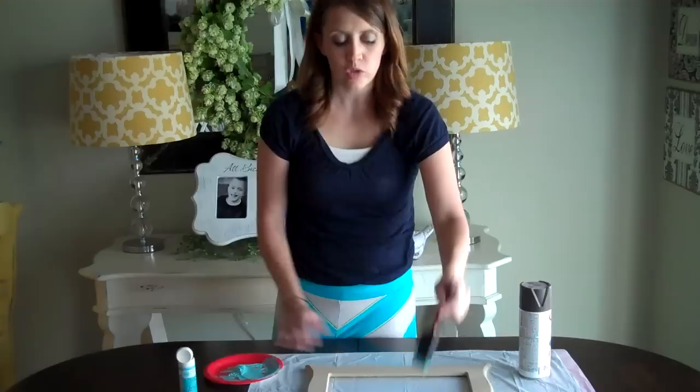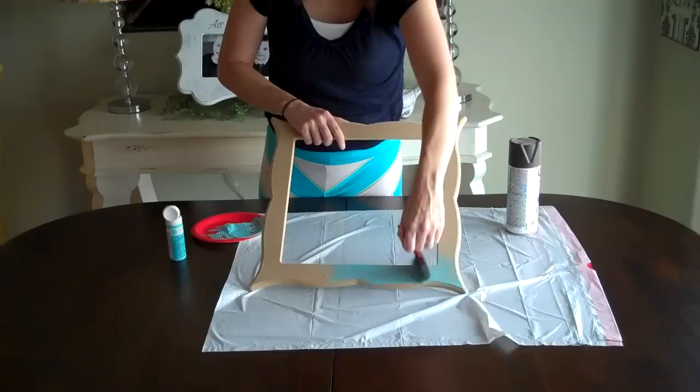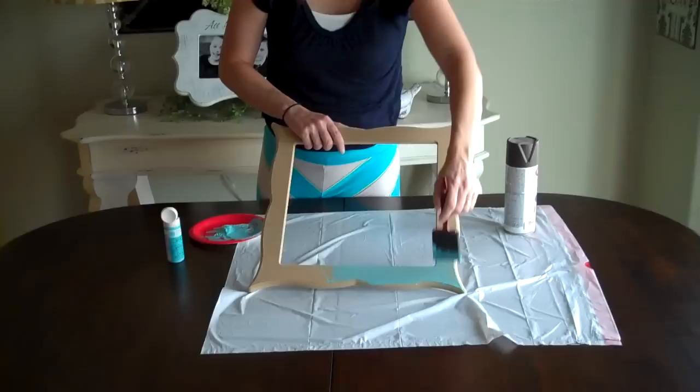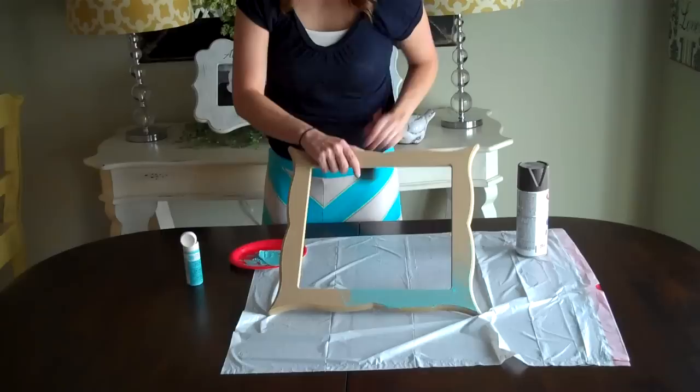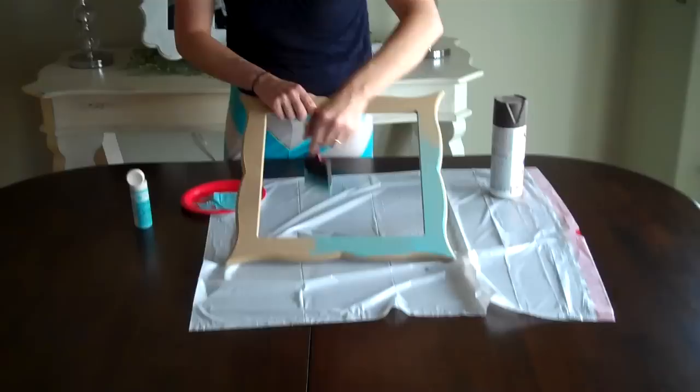You just need to do a real light coating on your project. The trick is don't try to pile it all on. You can do it fairly heavy especially on MDF and pine, but you don't want to be able to see streaks. Your paint shouldn't be so thick that you can have actual texture to it. Just stroke it on, and usually you want to make sure you're going in the same direction — that will give you a little bit of a smoother finish.